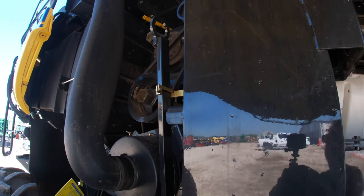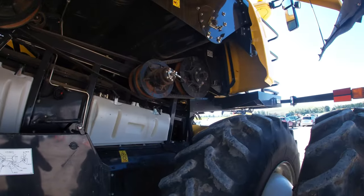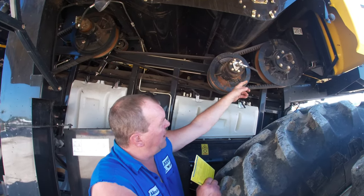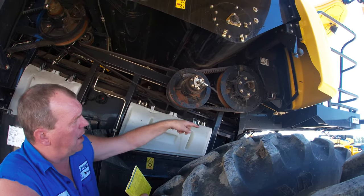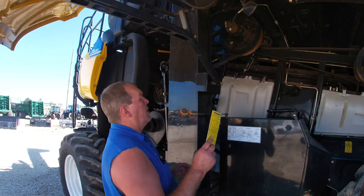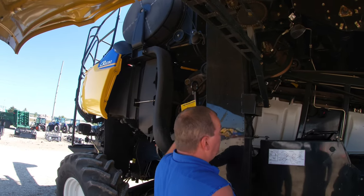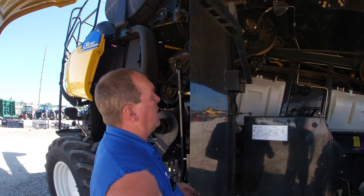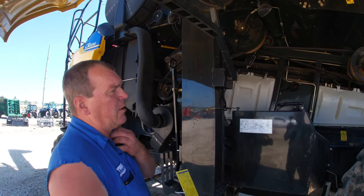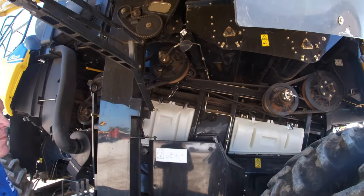The torque sensing sheaves for the rotor and the feeder have grease zerks inside, plus two rollers on the back side of the pulley on opposite sides that travel up and down the cams - those have grease zerks too. The older 900 and 9000 series combines have zerks on the back side of both sheaves. At the start of the season, grease everything up, then speed the rotors all the way up and slow them all the way down a couple times, and do the same thing with the feeder speed. That gets the grease completely worked through all the cams inside.